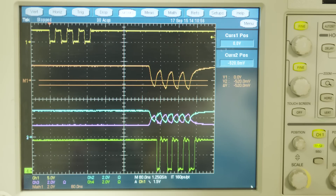On the screen we have the results from the first competitor's transceivers. The yellow trace at the top is the transmitter input, the orange trace below that is the differential signal at the receiver end of the cable, the blue and pink traces are the transmitter Y and Z signals at the receiver end of the cable, and the green trace is the receiver output signal.